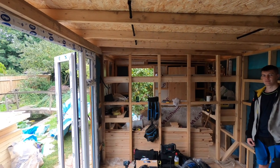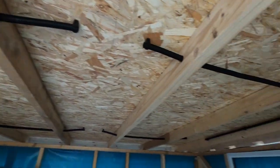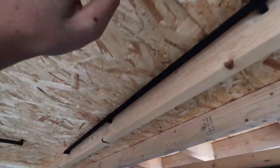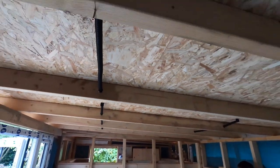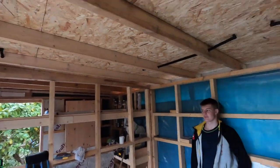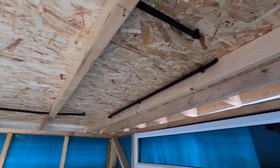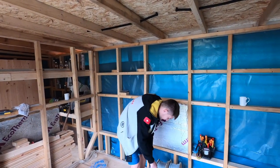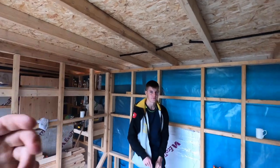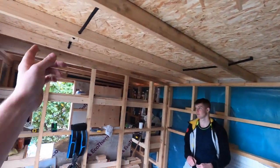If I had an extra kid and lost my office, I would have built something like this. We've got the flexi-conduit in now — I'm really happy with the finish. Nothing's going to be seen, but you can see how the cable's going to be protected. Left here where the downlights are going. The screws are bigger on the joist — nice and level, nice and square, nice and straight. We're going to see if it's more difficult to pass the cables this way. This should be easier because it's supported. We need enough slack and loops. We might be able to do one continuous loop, but it doesn't really benefit us — it's easy to just cut it every length.